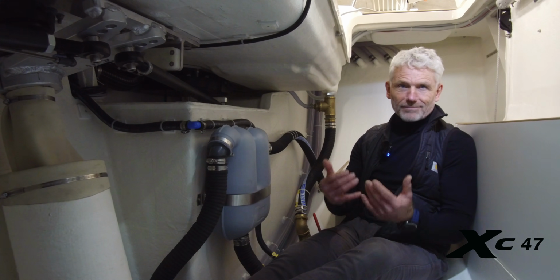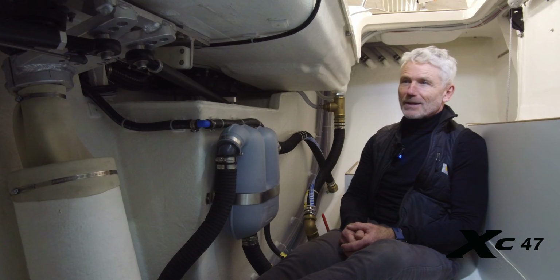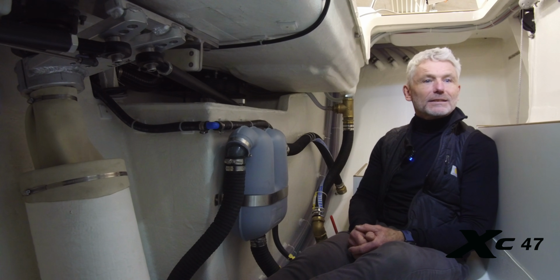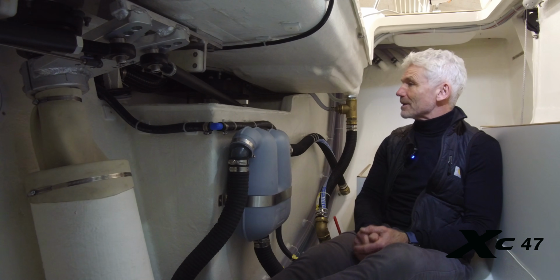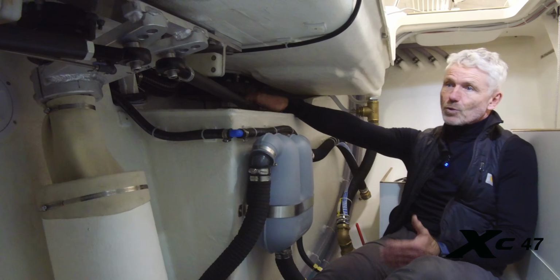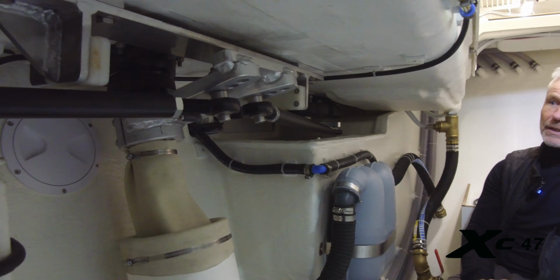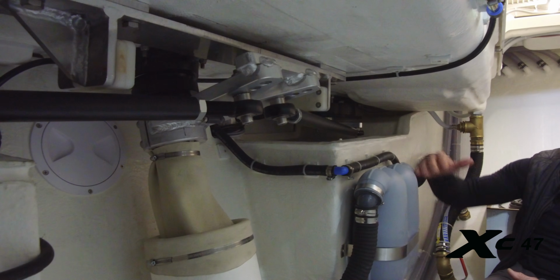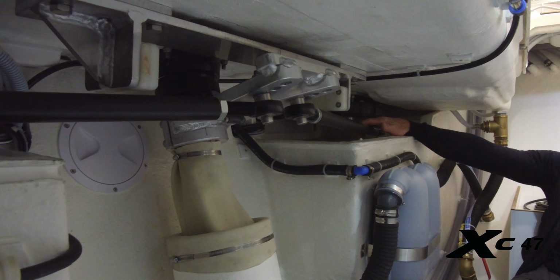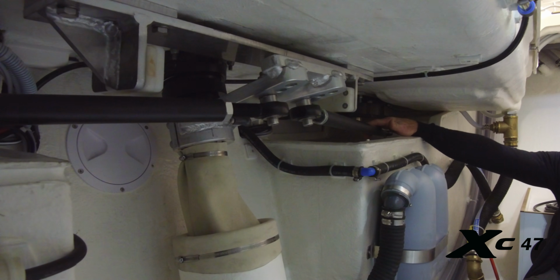So Stuart, I asked you to come down into the aft locker here to show you some of the systems that are out here and how easily maintained they are, and the nice finish of the GRP, and also this steering system, which is basically two systems, one from each helm, going into one rudder in the center. Having two systems means that if one breaks down, you always have the safety and backup of the second system. Yeah, I noticed that there were no wires or chains.